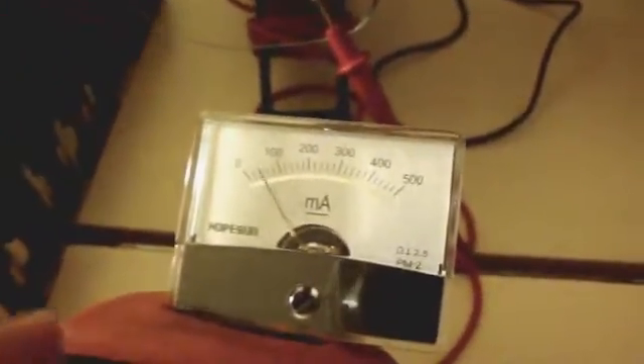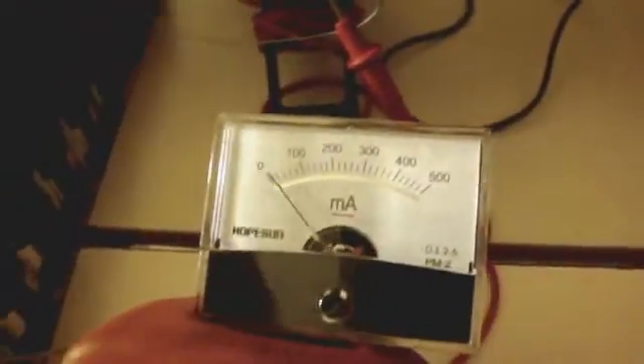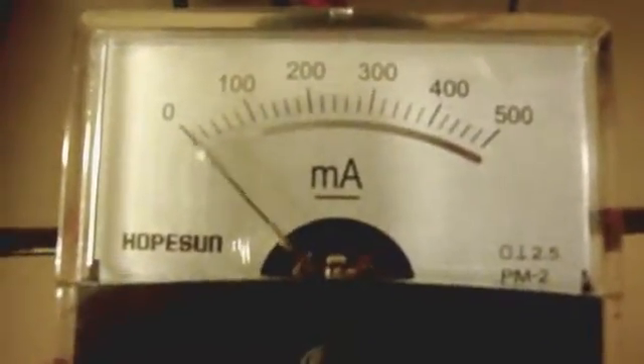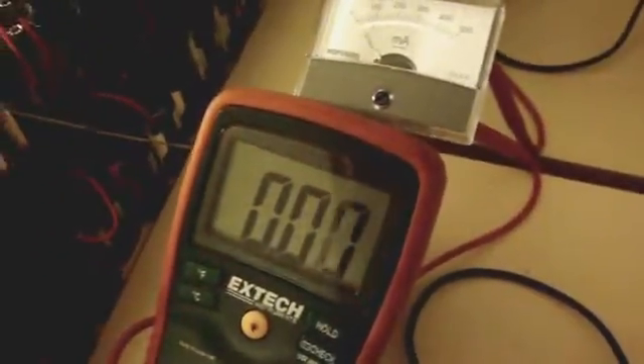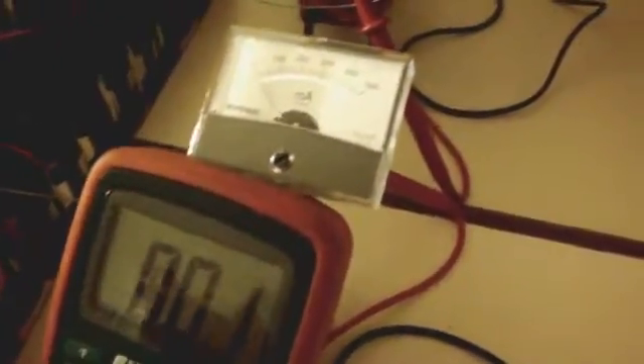For people with a little bit slower eyes, they can tell the difference, because it will be easier to check the low versus the high — which means the needle spends a little bit more time on the low. Since we see this going from below zero to just above the 60 milliamp mark, and the digital meter shows a range between 0.00 and 0.04, it is reflected that the analog meter spends more time on the low.